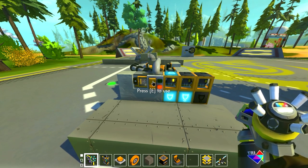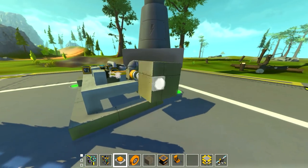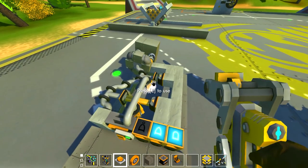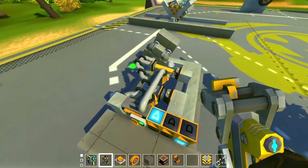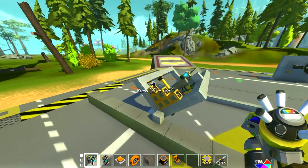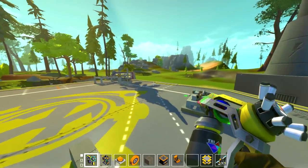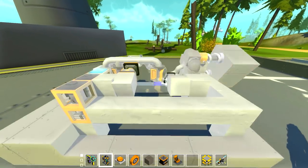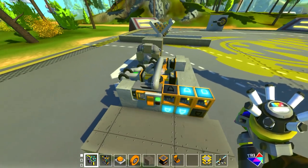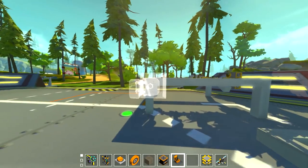And this makes a little bit smoother of an engine. You see here we don't need nearly as big of a flywheel. Although this engine is nice and compact, there is still that dead point where one is fully extended and one is retracted, and there's no movement in between those two dead points. So with this one, there's one dead point, but it's very aggressive because all the pistons are retracted. But this one, there's also a couple dead points per cycle. And so it's not very efficient. You basically need more pistons. And so that's where we get into this design.